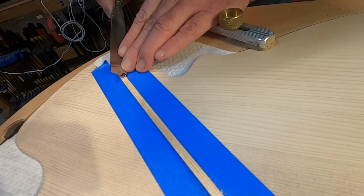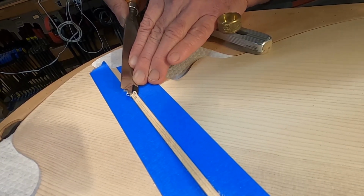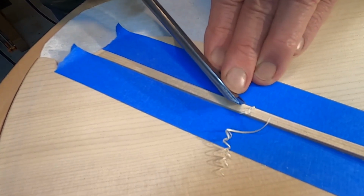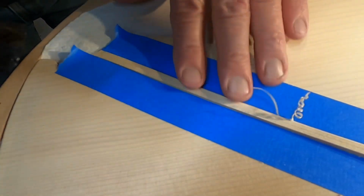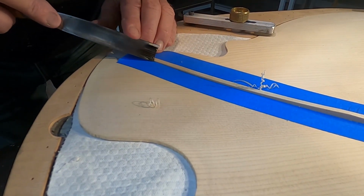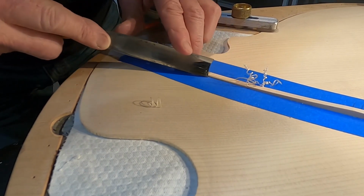Which is something we would expect. Usually turns around somewhere. In other words, I've gone to great trouble to get the brace wood exactly the way I want, in fiber orientation. And I do that on the bandsaw and, you know, with a hand plane, try and get the grain orientation perfectly vertical.